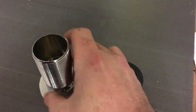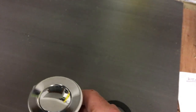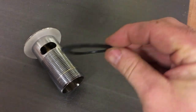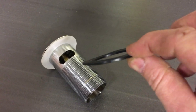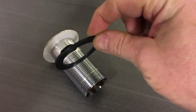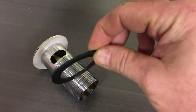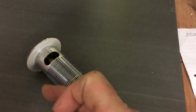These come supplied with a foam washer. Basically, this will go into the basin from this side. Normally, this is the washer you would get in the kit with this pop-up waste — it would go up underneath the basin and a nut would tighten it up. It's supposed to be a seal, which it never does, and that's why you always end up using silicone or plumbers mate putty underneath the basin.